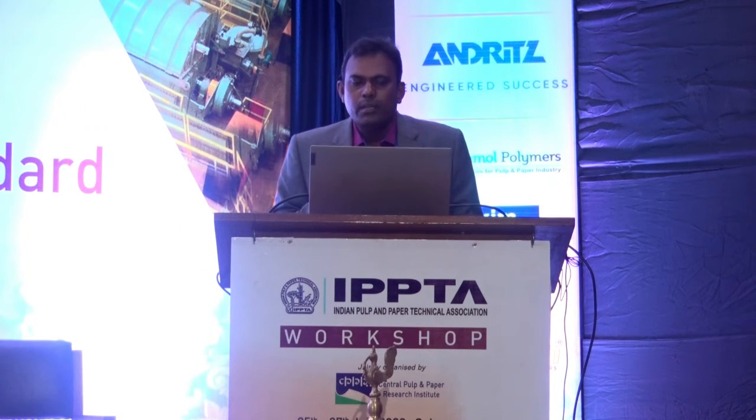Second is that when you have the press as a barrier before the bleach plant, from 30% to 12%, you have to use this D0 filtrate water and the other filtrate water. So that 50% of this acid filtrate water also you can reduce, as it will be taken for this dilution. So then your bleach plant effluent also will be reduced. So these are the many advantages of having this press in the last stage in post-ODL as a barrier.